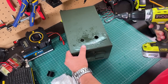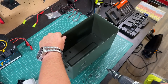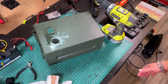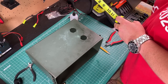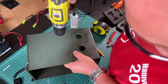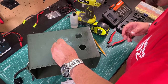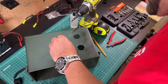We're getting there, and now we'll try the big guy. Look at that — beautiful! That was more difficult than I anticipated. Next I need to drill a hole for the BNC, and I want that to go right smack dab in the middle. What do they say — measure three times and cut four times? Three-eighths of an inch, and she fits. Beautiful. Then lastly, we need to drill a hole for this switch. We went two and a half in on these guys, so I'll go two and a half and follow the center there.